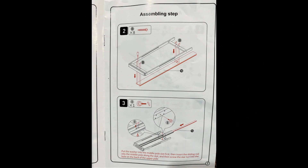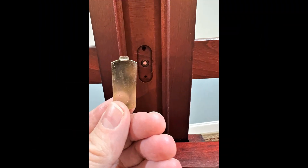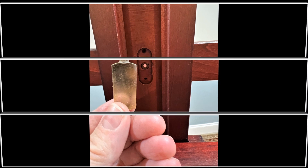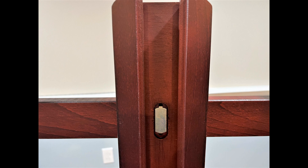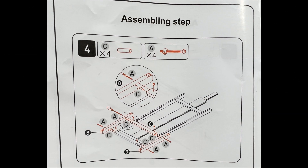Assembly step two is to put the guide rails in place for the slide. Number three showed you the slide — there it is assembled. Before you fit it in place, you need to put these clamp blocks in there. They're brass fittings that you just press into the holes. What they do is when the thumb screw on the back applies force, it spreads the force over a larger area so you get a better clamping result instead of the thumb screw pressing directly onto the wood. There's the thumb screw in place applying pressure to that clamp plate holding the slide.